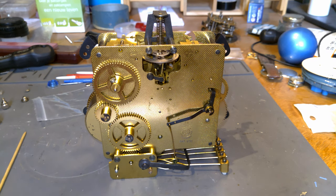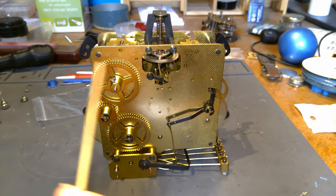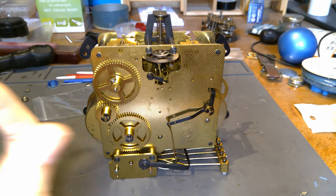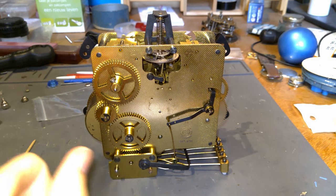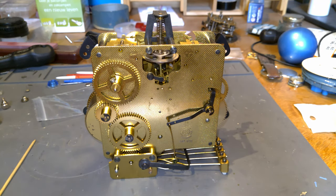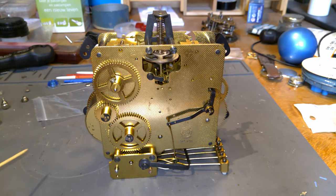So it's time to find out if you guessed correctly. The reason they spiral in two different directions is that if you would just do one spiral, while moving left to right you would get a movement up and down — because in one direction you are winding the spiral tighter so it goes up, and in the other direction you unwind it so it goes down. By having two spirals opposite to each other, one is winding up while the other is winding down, so they cancel each other out — and you can see here it just stays in place.